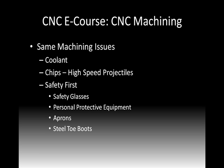That brings us to the next point: we have to be very aware of our safety. Before this, in the various steps of CNC, there weren't things flying around or the chance of them hitting us. Now we need to wear safety glasses when we're out in the shop. We're going to need personal protective equipment — heavier clothes, maybe a machinist's apron, steel-toed boots, that sort of thing. Safety can even apply to the movement of the machine itself. These machines are very powerful and their movements could knock people over or pin them against various items if you don't know their movements well.